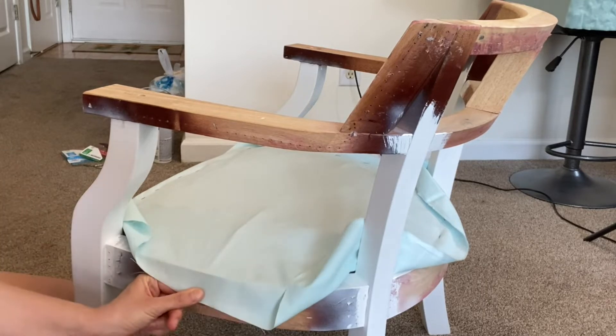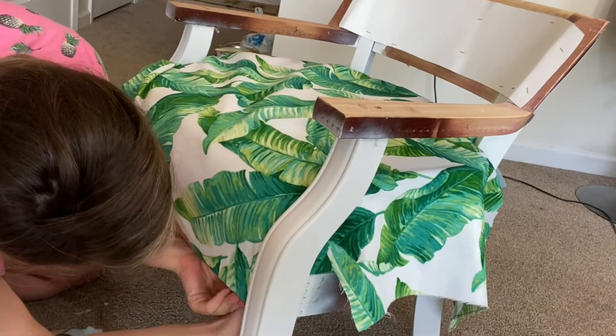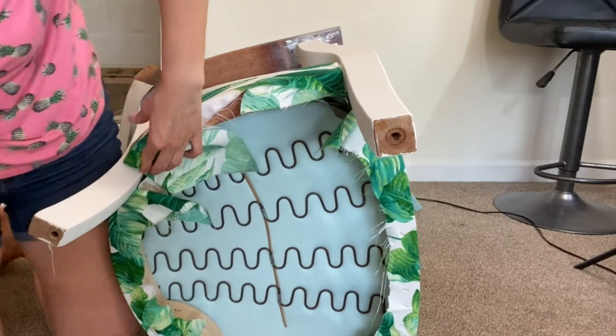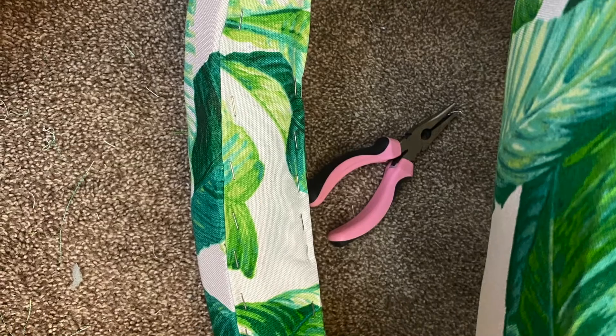I sometimes go to Walmart in the fabric section and they have pieces of fabric for two or four dollars, so I put that on top of the springs because they were a little bit rusted. Then I put the padding on top and cut it a little bit on the edges so it would be nice and taut. I stapled the material on opposite sides starting at the middle or starting at the edges depending on the shape of the chair. The armrests probably took the longest because they have very little fabric especially on the sides and they have very weird shapes — but just staple under and then put a piece of fabric over that.